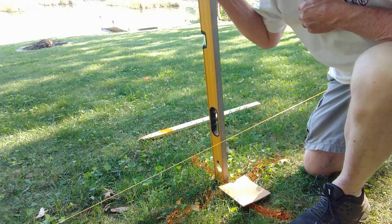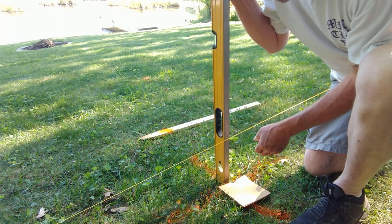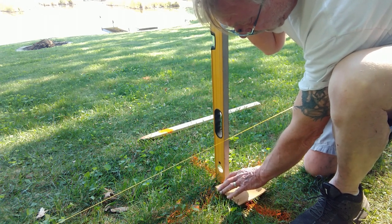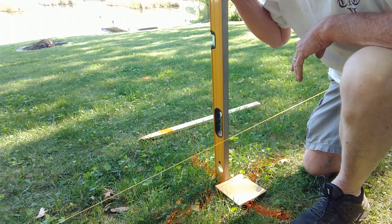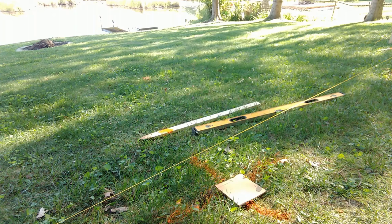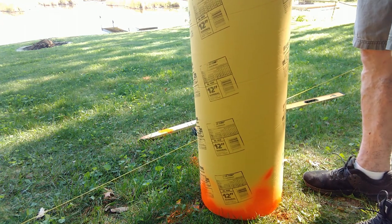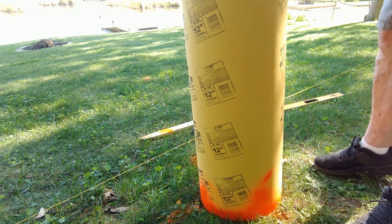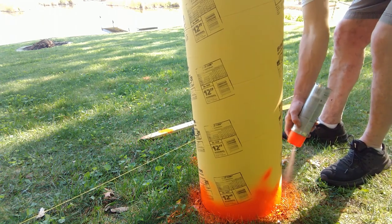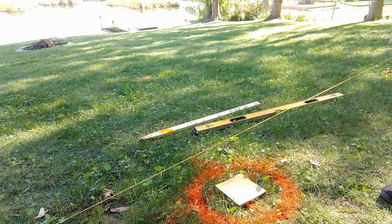Just a little tip here: when you're setting your posts and you have a 6 or 8 inch distance from your string, you'll need to use your level and get it nice and level against the string so that you can move your piece of cardboard right up to your level. That way you know that is exactly where your post is going to be. Then we're going to take our tube, push the string out of the way, and center our tube right over that post. It doesn't matter if you're a half inch or a quarter inch off. And we're going to mark it — there we have it. That is exactly where that tube needs to be.